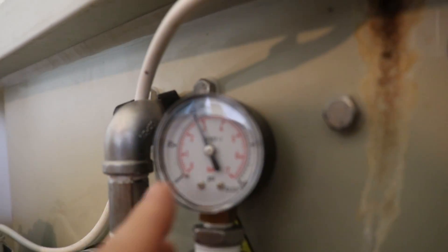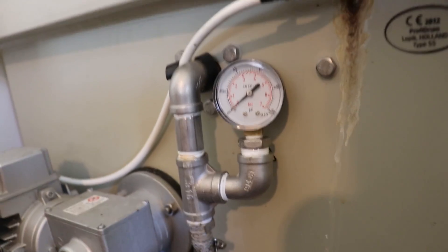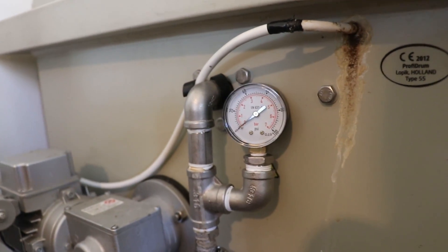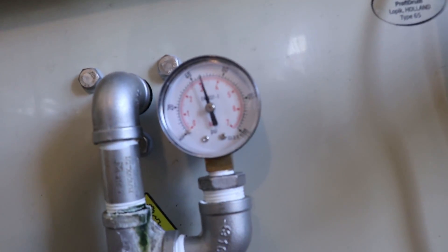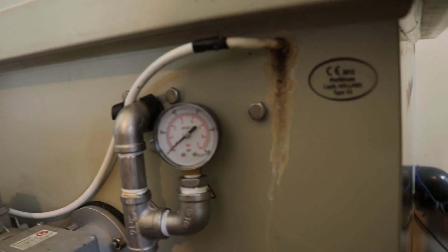Basically when that's shut we run the booster pump, and the booster pump can do 40 psi which is almost three bar right there. I put these little gauges on them so that I could see where the spray bar was blocking up or the pump was reducing in power. I was also just curious to know what sort of pressure you could get from these filters. The main pond's also got one — if I run that it should be very similar. That was slightly more but that could just be an inaccuracy in the gauges themselves. So we've got a three bar pump at 40 psi.